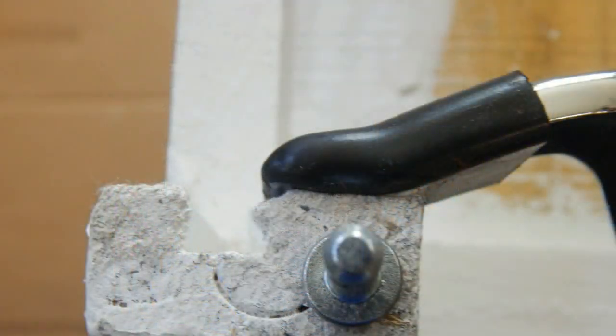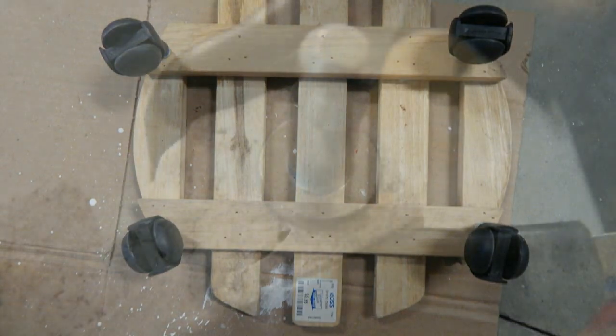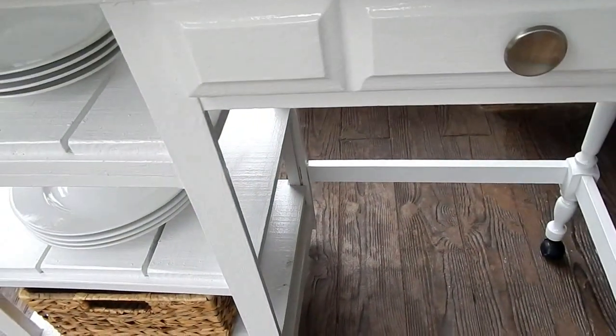This is where I started getting really nervous. I had the right boards and everything was going my way, but then came the question: what caster wheels are you going to use? Every place I shopped, they were too big and the base of the legs was super narrow. So I looked around the house — out on my patio I had a planter base with wheels on it. I turned it over, took the wheels off, and recycled them. I put clamps on the legs and drilled holes just the size of the insert for those caster wheels, and it worked out beautifully.